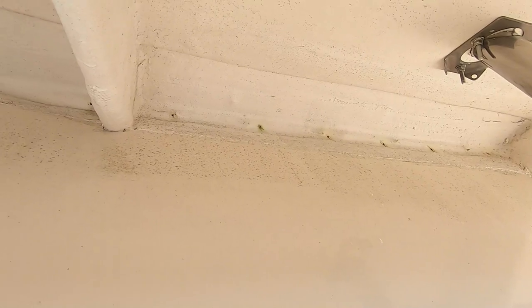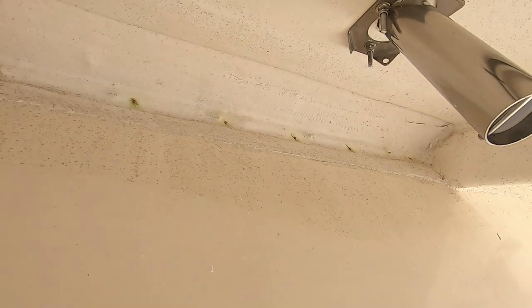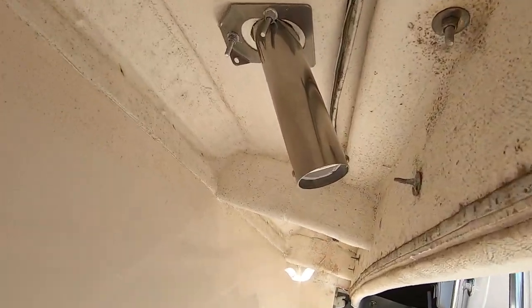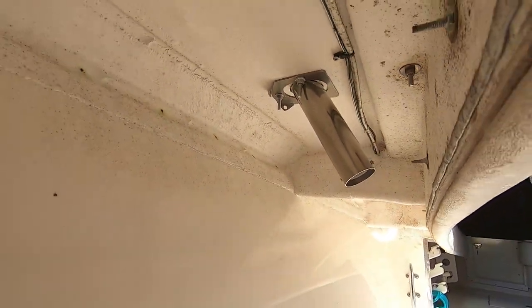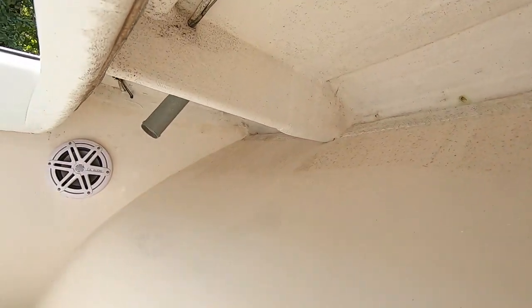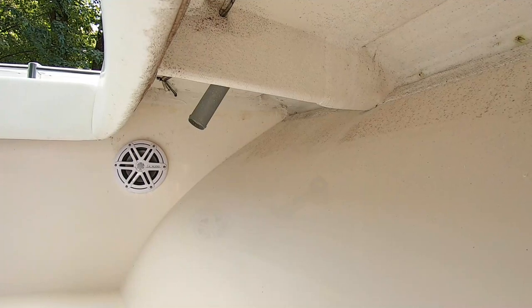What Contender has done is they've bonded their cap to the hull and liner — the liner on the inside and the hull on the outside — and they've basically fused it all together with fiberglass, probably 1708 or 1808 mat. They have these stringers, and if you look closely you can see the ends of some screws and fasteners along with heavy glass mat, so it's very strong. And there's something else you can mount underneath your gunnel cap — speakers, for instance — which keeps them out of the weather so they'll last a little bit longer.